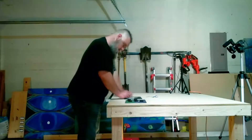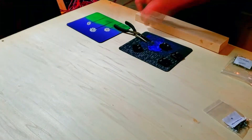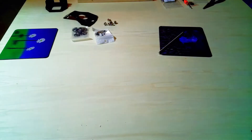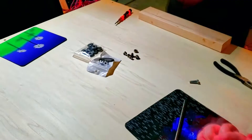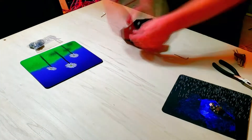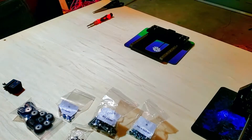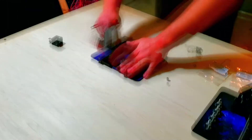After a lot of reading about people's thoughts on these machines — their concerns and praises — I came up with my top three list of wants. First, I had to agree with a lot of people that belt-driven machines were a no. I wanted rigidity in the machine and its parts. With my 3D printer's wooden kit, when my speeds were too high it would rattle and I'd get messy output. In a CNC machine, the stress and torque during cutting opens the door for skips when using a belt. Threaded linear rods are the way to go, and no wood.